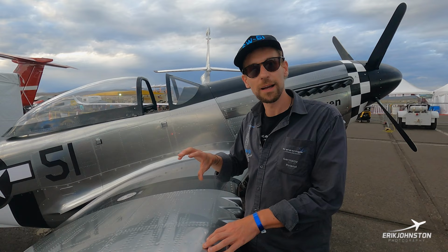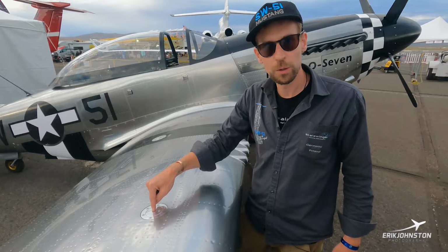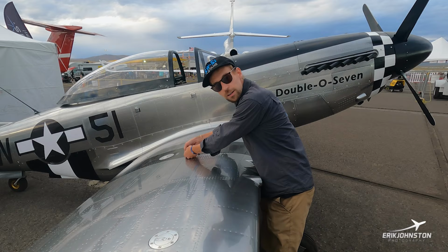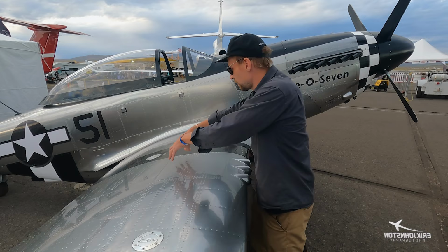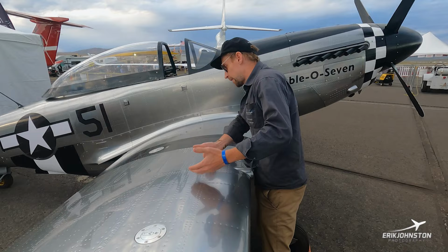And now we come back to our fake filler cap, which is already here, because this outer auxiliary fuel tank will be located here in the outer wing, and then we will replace this fake fuel filler cap with a real fuel filler cap. The idea of this auxiliary fuel tank is to be connected with the center wing tank, and also together with the ventilation. So this auxiliary is feeding the center wing tank, and once that's empty, you use the fuel from the center wing. We have a natural gravity feed, as this wing has a V shape, so the fuel has a tendency to move inboard.